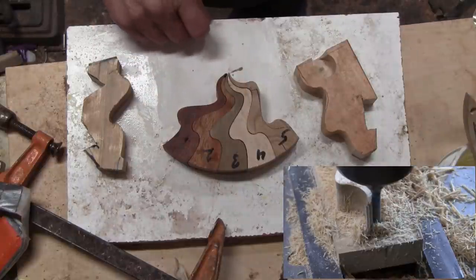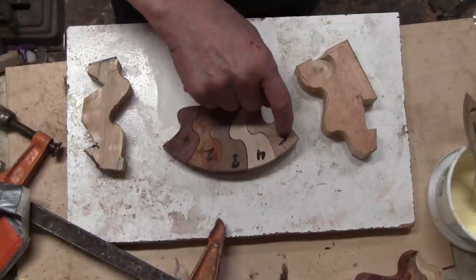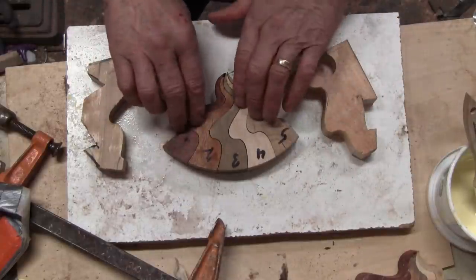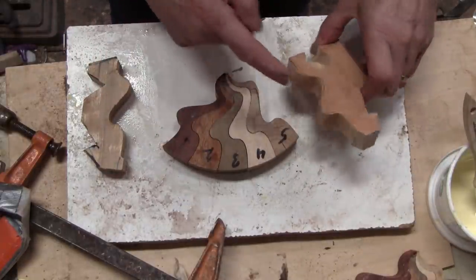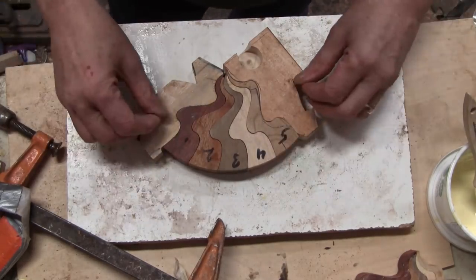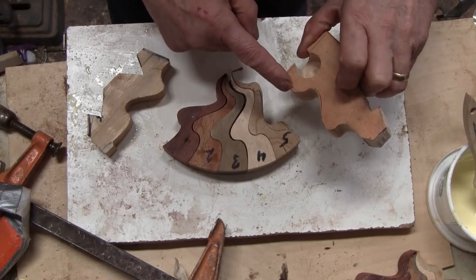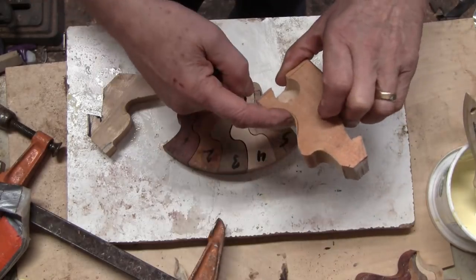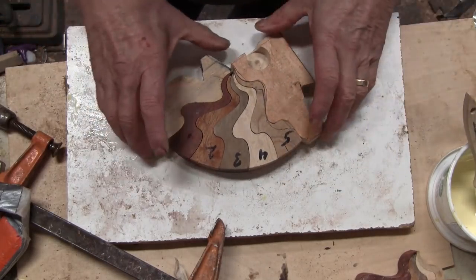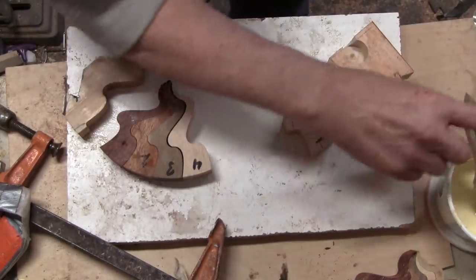Time to glue them together. I have all the pieces cut — padauk, mahogany, walnut, birch, and cherry. I put numbers on them so each section is exactly the same. I've also machined some little fixtures that fit in here and allow me to get clamps on it and pull it together. As I showed before, this line is identical everywhere, so I just cut half on this side and another half on that side. It'll be lots of glue but I think we can get it done.